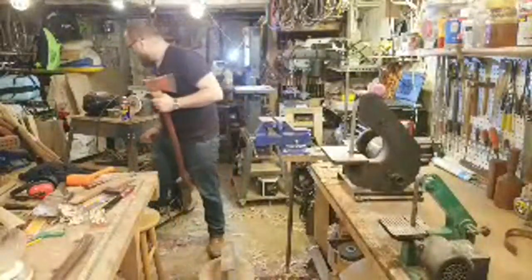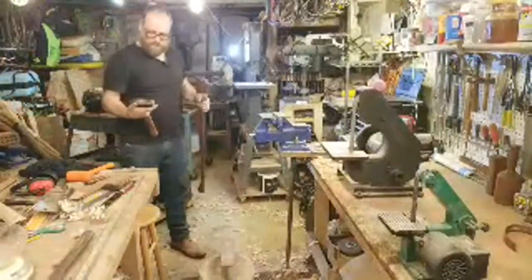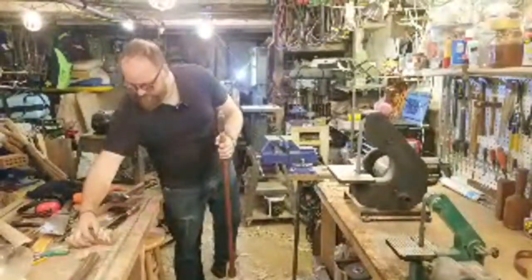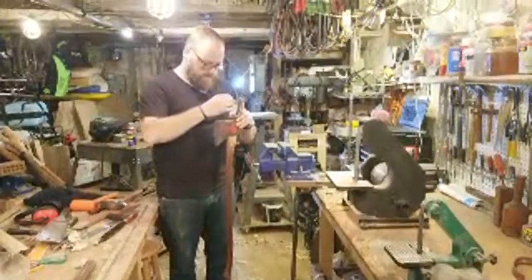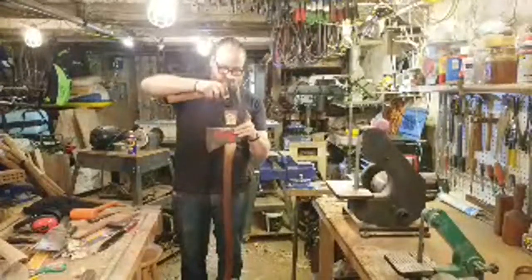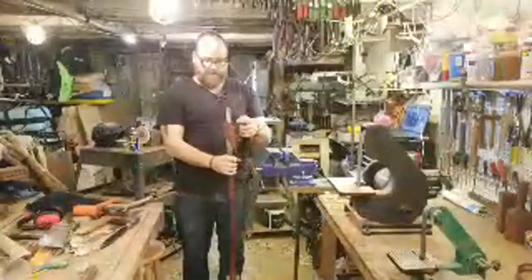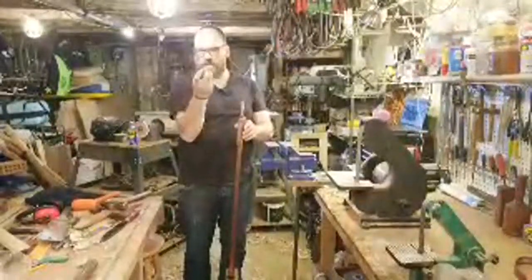And let's start with a cross peen. Or actually straight. So we'll go ahead and start the wedge in the front. Like so. Get right in there. And when I was grinding this wedge, I ground the very edge of it to a real fine point. I flattened it first so it was thick and robust, but then I ground a bevel on it. That just helps it to get into that kerf.